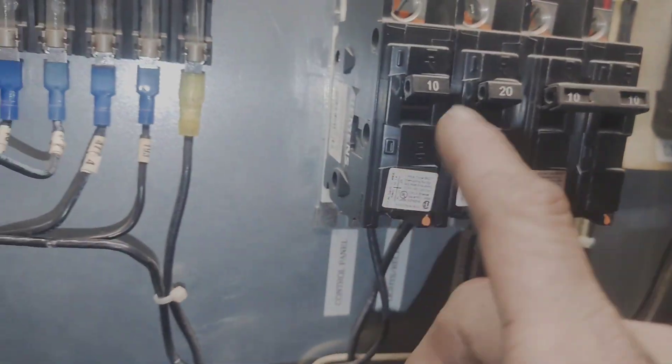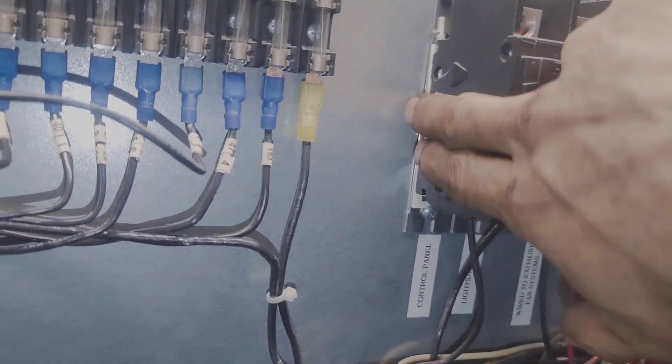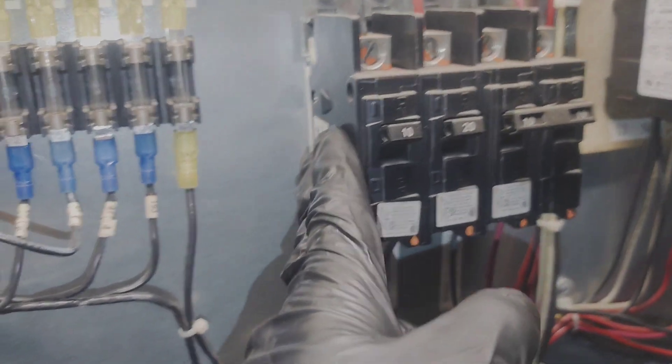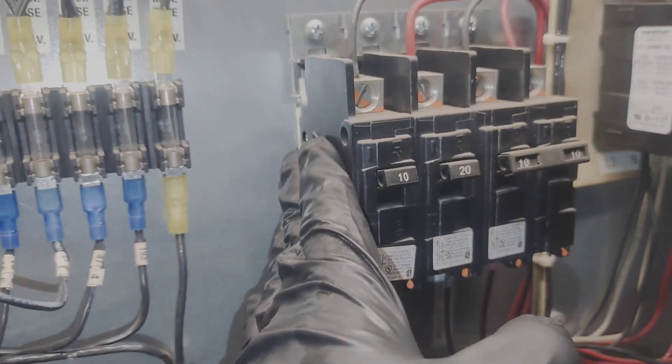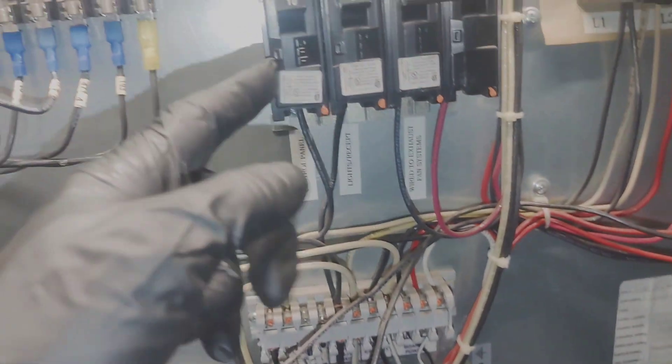The reason the rack stopped working in the first place is this breaker trip. It also powers the E2 controller we were just looking at, and it was tripped. I don't know why it was tripped — it was not over-amping and it's not getting hot. You want to pay attention to that kind of stuff. It was pulling 6.5 amps — if it was pulling 6.5 amps and getting hot, that could potentially be a problem. That's how breakers get weak. I had all these wires off because I was tracing back what was pulling 6 amps. But it hasn't tripped again, and because of the power issues we've been having out here — power outages — it's probably electrically related.